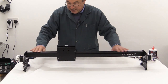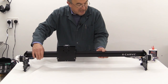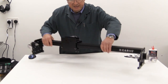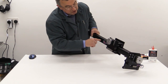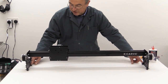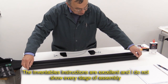We then brought it together by doing the gantry, which consisted of these two maker plates — one has the X-Carve logo and the other doesn't. Remember that the v-grooves: one is on the very front and the v-groove here is on the very back. Also remember that this maker plate at the back has the slot running along nearest to the top. When handling this and putting it to one side, remember it's got its little pulleys at the bottom so it's liable to slip off a bench.